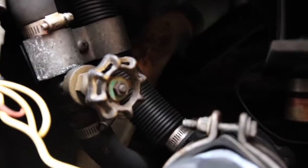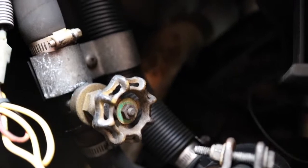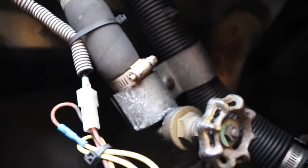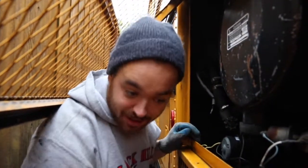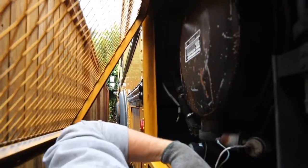There is a knob in here that turns off the coolant that runs into those lines in the heater. I'm gonna just crank it, put the bucket in there, and we're gonna drain this sucker right out.